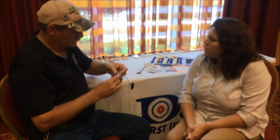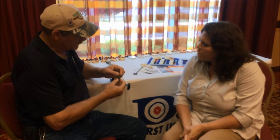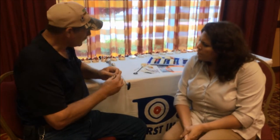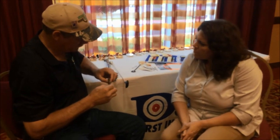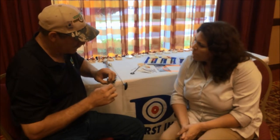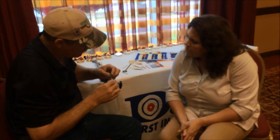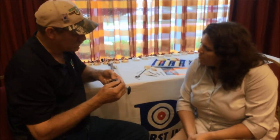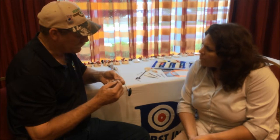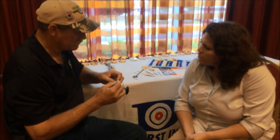The trigger assembly here — the pawl is missing, the trigger is missing, and the springs — but you've got a mechanism here that releases the main spring, so you've got friction points in there. You can use the little Q-tip-style swabs or the paddle ones here to get some grease right down in there. You can do the same thing — put some polishing compound in there and slick it all up. Save your emery paper. These little ones are really great for getting into tight little pieces.